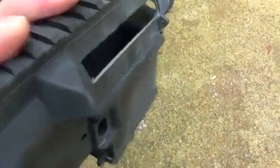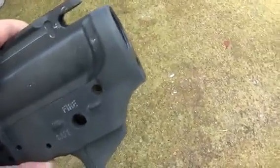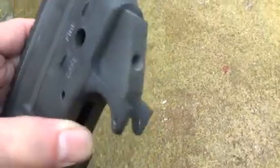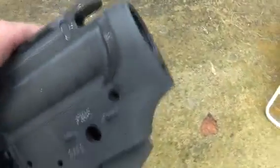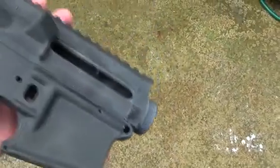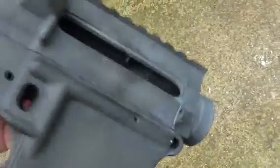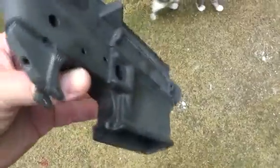I was going to put it in a bead blasting unit, but I was afraid that if I took out all the media that I have in there and put the salt in it, there might still be some of the media in there and it might damage the anodizing. So I just did it out in the open with just a regular sandblasting air deal I got from an automotive place, and that took care of it. And I hope this helps you out, anybody that needs to take away Cerakote.